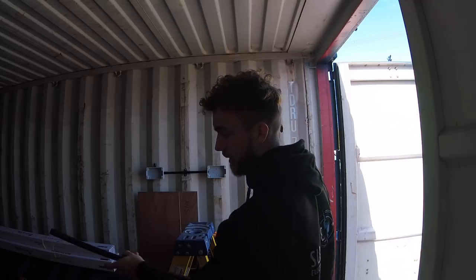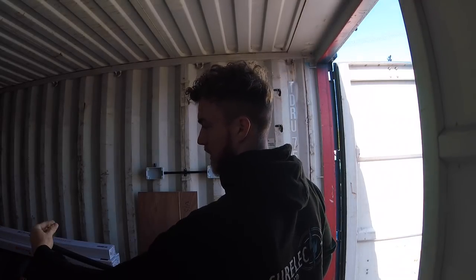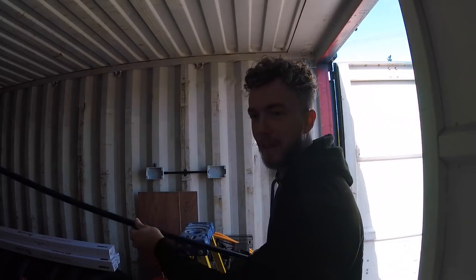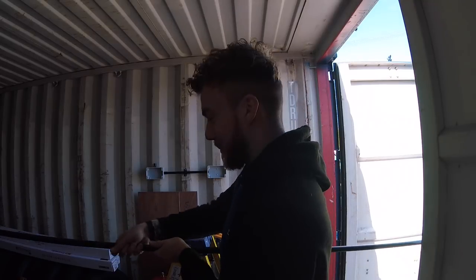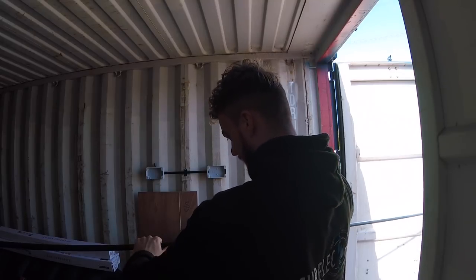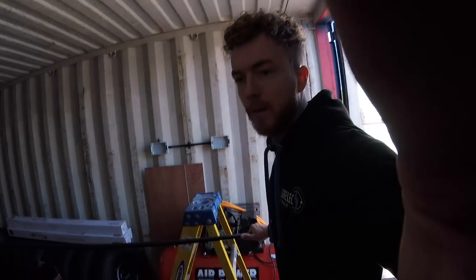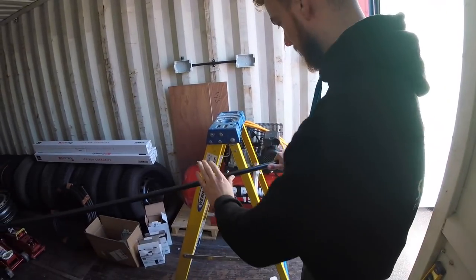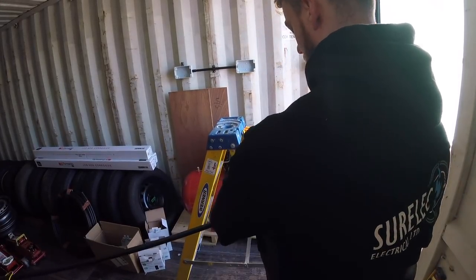It's a bit of a funny thing to do, but rub the conduit off is probably the nice way to say it, where you're going to be bending. This just heats it up a bit more and makes it a bit easier to bend. And all we're going to do is bend it over the knee. That way you can see down there. So our mark is just there. Bend it over the knee.